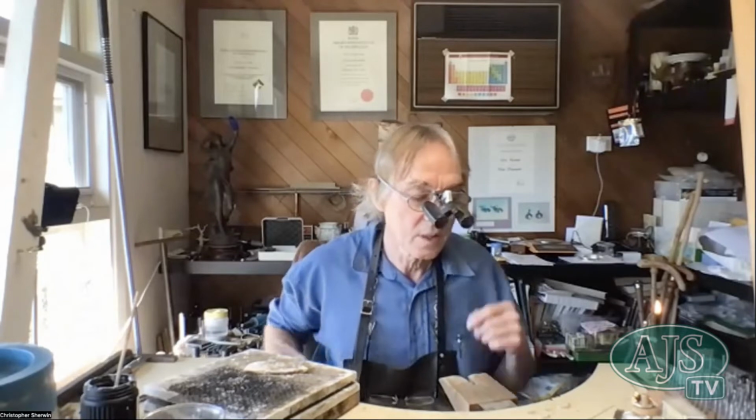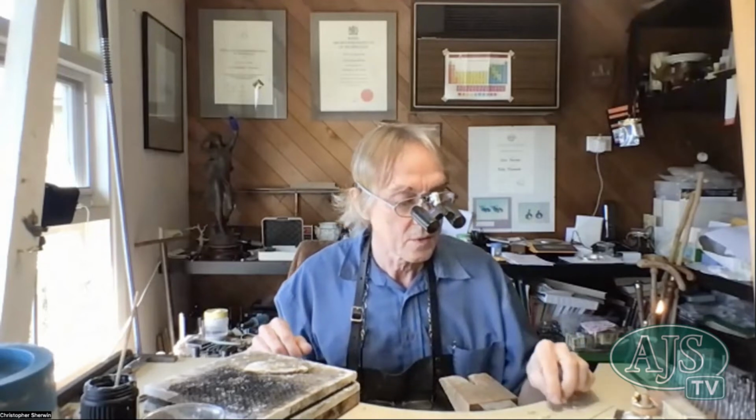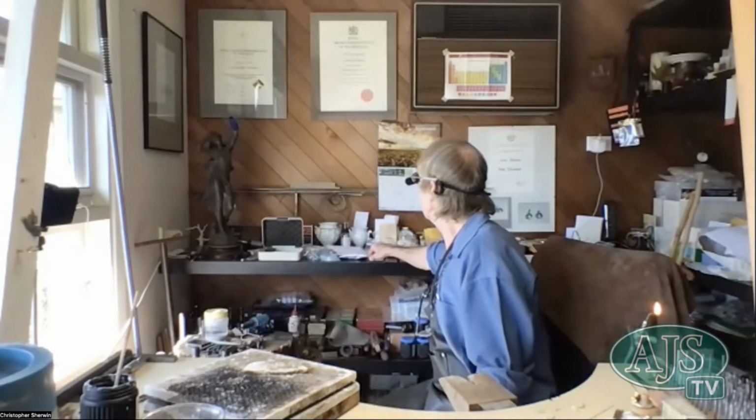Excellent. That's a very straightforward, up one size without all the tapping. And you're adding metal to the ring, but it's a butt joint. It's a very straightforward type of resize. What we want to do today is something a little bit more complex, where we're going up perhaps a few more sizes and we want to create real strength in the joint. So the two joints I want to cover today are more of a zigzag joint. I've got a couple of sketches here.